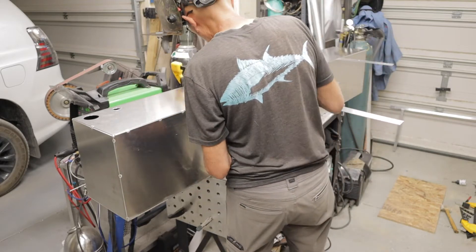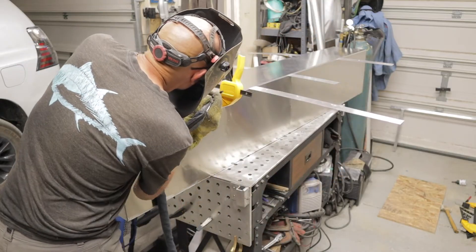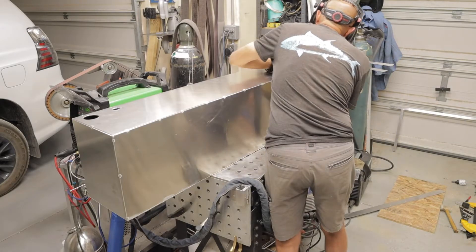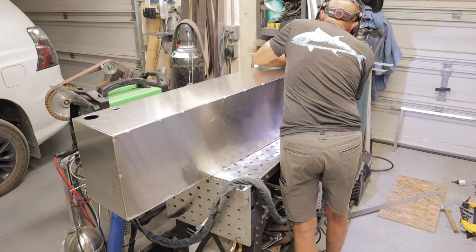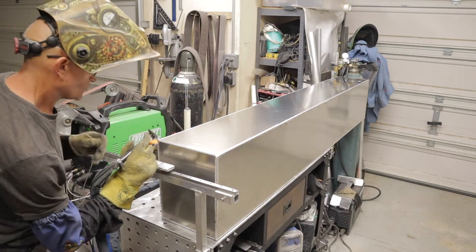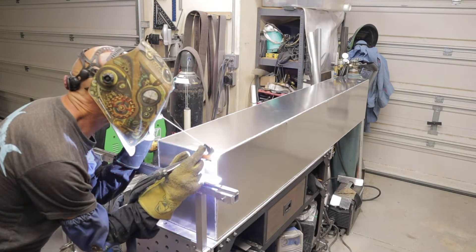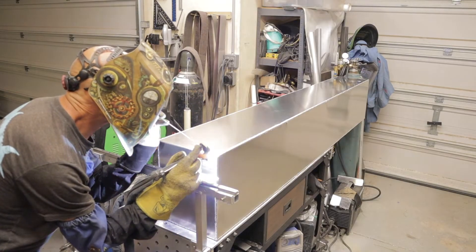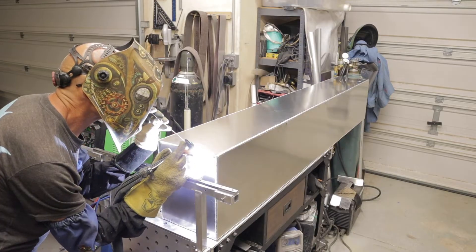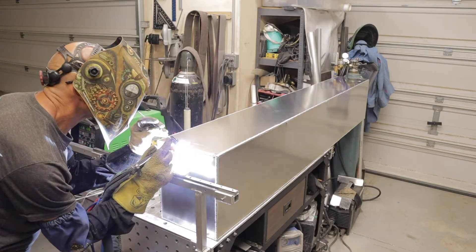You'll see that as I go I pull out the slats so I control the alignment as I go down. The tacking process is one of the most tedious parts — you're trying to make sure everything stays square and looks good. It makes it so much nicer to weld when you have a nice even bevel to weld into. Here I've set my linear bearing up so I can weld the ends. I've welded all the sides at this point. You can see I have a little pad set up that I rest my hand on, and I can just slide along — it keeps any drag down to an absolute minimum.